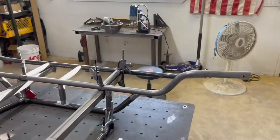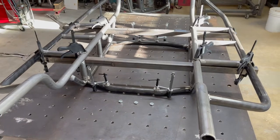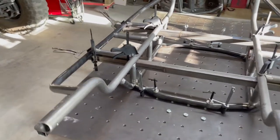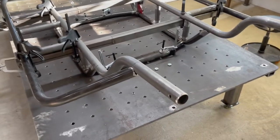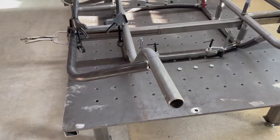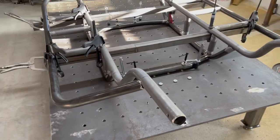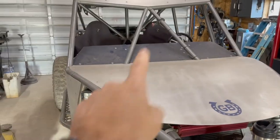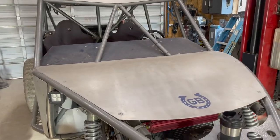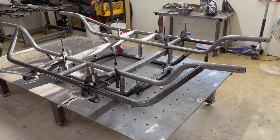The subframe is the very foundation of any chassis. The majority of the chassis — 99.9% — is built out of inch-and-three-quarter DOM tubing, with inch-and-three-quarter being the outside diameter. There are a few tubes on this chassis that are going to be inch-and-a-half in diameter, but very few — basically just the window bars. Everything else is inch-and-three-quarter DOM tubing.